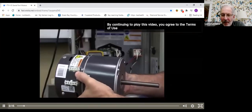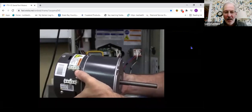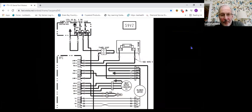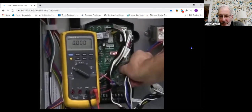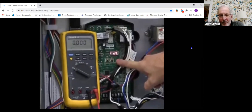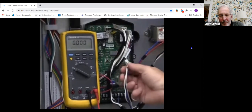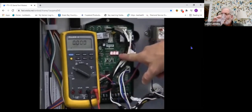The 4-wire serial port motor uses digital communication between the air handler airflow control board or furnace IFC to tell the motor what speed and CFM we need to deliver. The motor must always have 120 volts on a furnace or 240 volts on an air handler. The next step is to apply 24 volts to the back of the motor — the back two pins are common and red for 24 volts hot. When the motor receives that 24-volt input, it runs at about 75% capacity. If you disconnect the communication from the motor and board, you'll get an E17 alert for a blower communication error — check connections, look for a loose connector or broken wire.